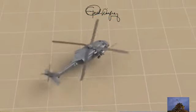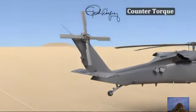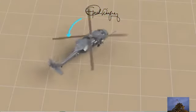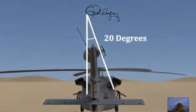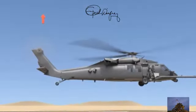The turboshaft engines are spinning these four massive pieces of metal one way. This causes the main body of the helicopter to want to spin the other way. If we did nothing to stop this, the helicopter would spin out of control. This is the reason we have the tail rotors in the back — they provide a counter-torque, a spinning force in the other direction.